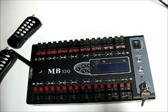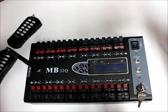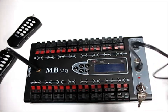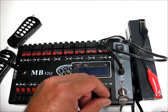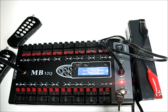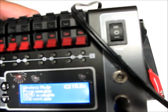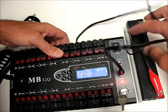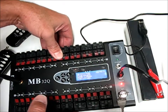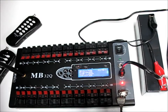Like the other RF Remotech systems, there's an available external power source receptacle. It can be hooked to 12 to 24 volts externally with the jumper provided. Right now we're hooked to a 12-volt battery. The firing system chooses the power source with more voltage — in this case there's 15 volts internally, meaning you'd actually have to take out the AA batteries to use this 12-volt external power source.